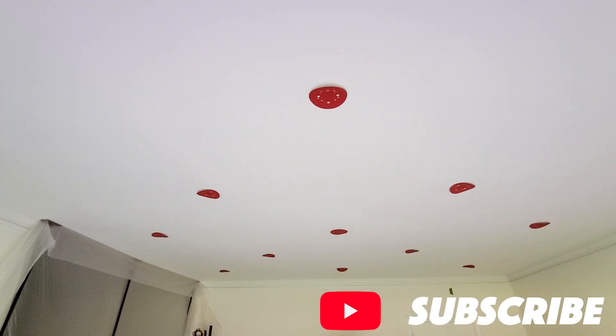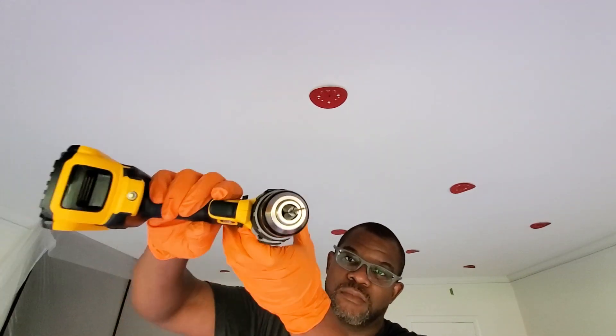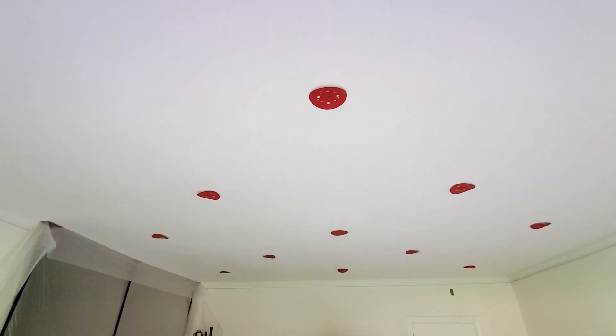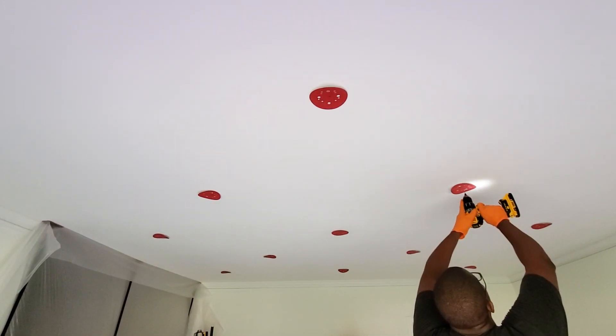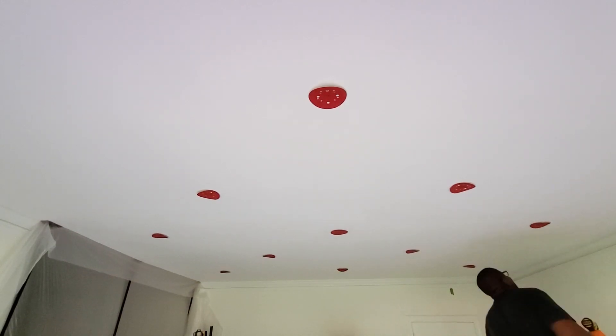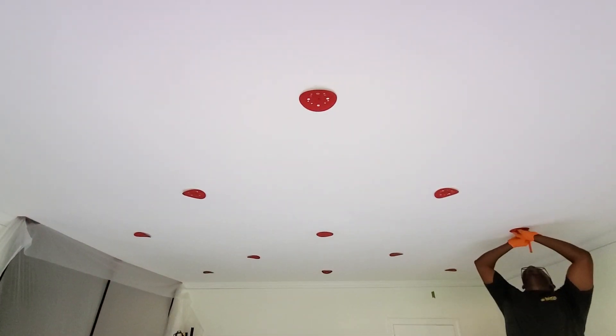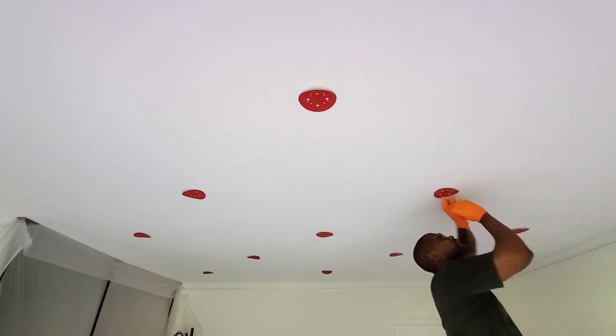We're almost done, and then we're going to start drilling out our pilot holes using a very small bit to make sure we've got our light locations exactly where we want them before pulling out all of our placeholders. The first thing I'm doing is marking the location with a black permanent pen, then drilling. The planning phase of doing a recessed lighting project is actually where you spend the majority of your efforts — cutting the holes, while not clean work, is pretty easy once you've confirmed where you want everything. That's what I'm doing here: making sure everything is located and laid out exactly the way we want it, so when we begin the phase we can't easily redo, we can do it with confidence.